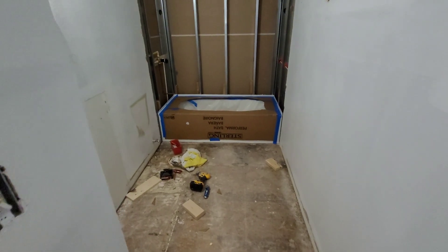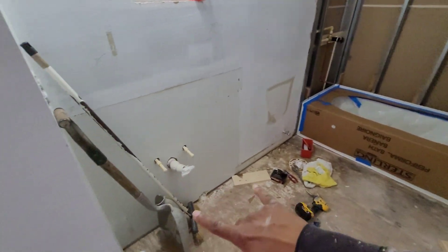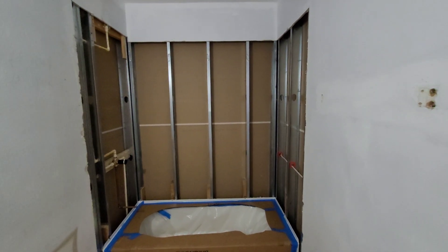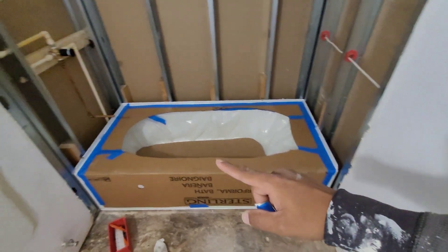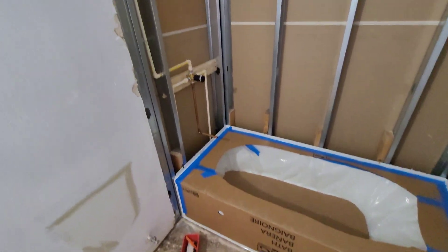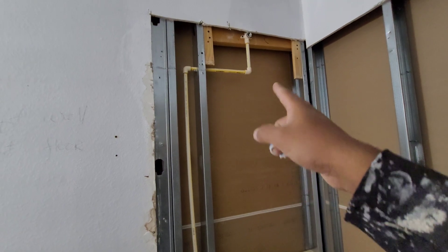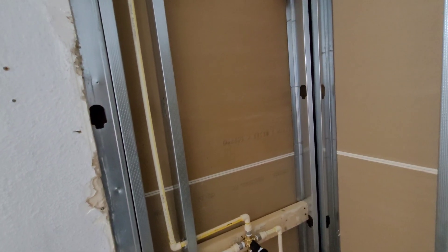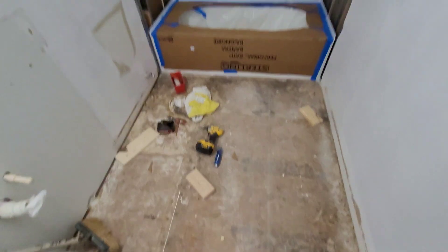So this is today's project. Yesterday we removed everything from this bathroom — there's a toilet over there, vanity here, and then the shower. Everything's gonna remain the same, just putting new stuff in. New tiles gonna go all the way around. The tub is already installed and I taped it up so I didn't want to damage it. Plumbing is already finished. The reason the plumbing is going like this is because I have to put in a shower niche right here. Then I'm gonna do the cement board on the floor — that's today's project.